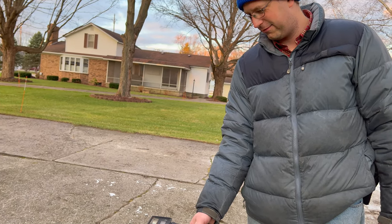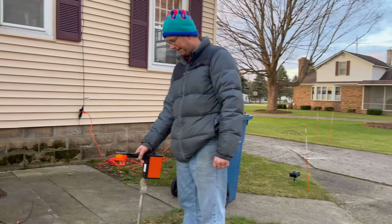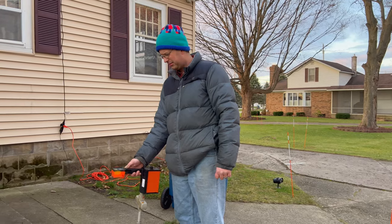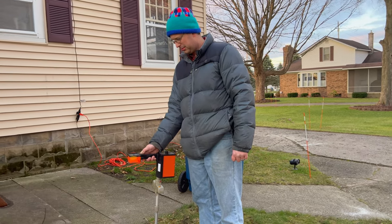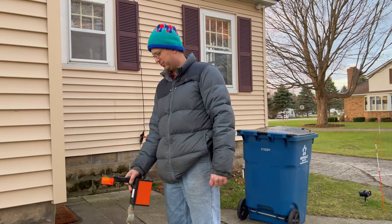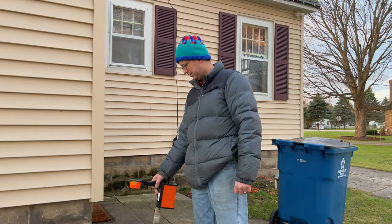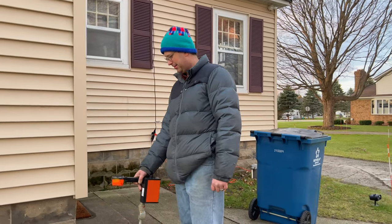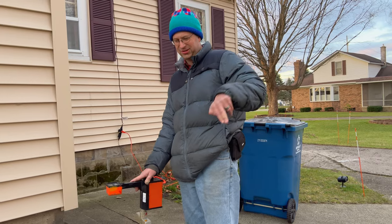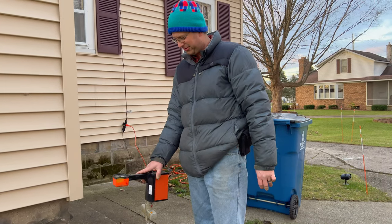Signal strength is 940. Okay. What's it at there? 850. Still not terribly low. No, I would say anything over 800 isn't terrible. Anything over 600 is usually pretty good. Oh, good, because I was totally guessing. It does drop quite a bit, though. The thing with a break like this, if it's just a slice in it, it's still going to be enough to send that signal on.